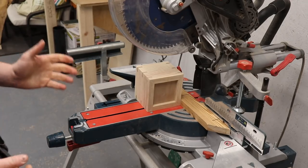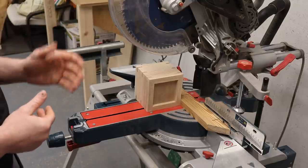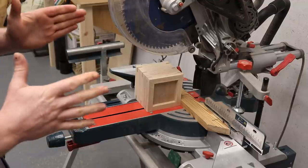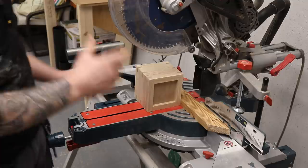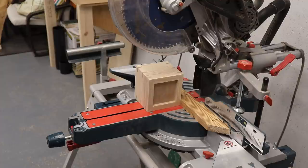Time to cut the lid off. I was going to take it to the bandsaw, but it's a small box and my mitre saw has such a massive depth of cut I can get through this whole box with nearly one cut — it's extremely accurate and gives jointable edges. So I'm thinking I'll chop it with the chop saw. I've never done this before but I don't see why it'll be a problem — I have a nice straight edge, the full range of cut. My bandsaw doesn't cut straight, and I don't have a table saw, so yeah — let's do it. It's an experiment.